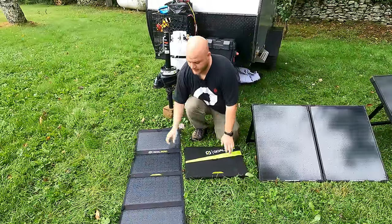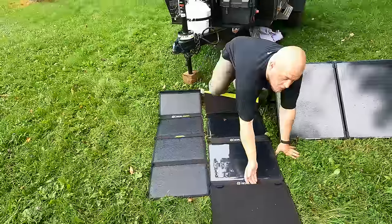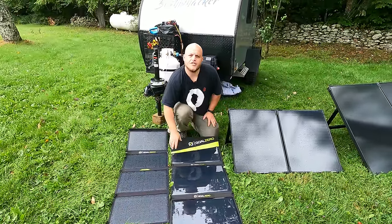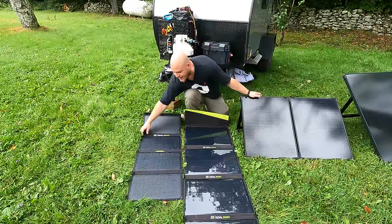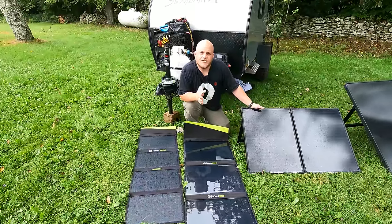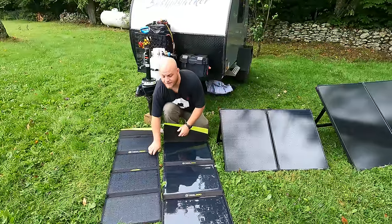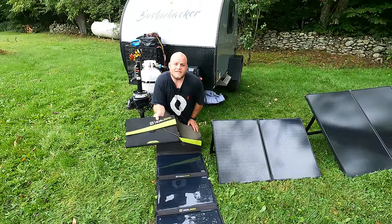You can also get portable panels that are lightweight and fold up. This one we're looking at is actually the same wattage as the glass panel, just in a linear shape instead of a big square shape. These panels are capable of getting just as good a charge. They do require that you hang them from hooks off the side of your camper or lean them up against a cooler. For that reason, most people see lower performance out of these panels than out of the fixed glass panels. The advantage is that when they fold up, they're extremely lightweight and very easy to store.